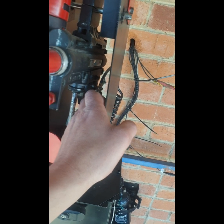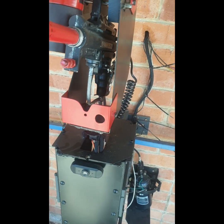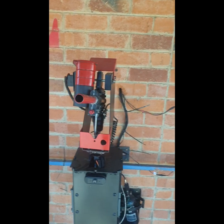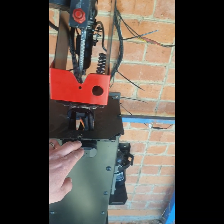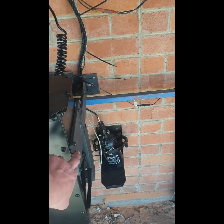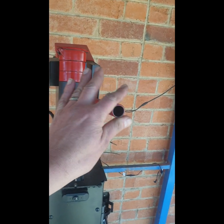Then we have our trigger servo, and she is located inside the handle so that it's out of the way, and all these wires run to the brains. I'm going to try and get in here at the back. That little box where you see that little LED light is the box where the Arduino board has the code that sends the instruction to turn left, right, up, down, fire, attack, blast, call it what you want. That's as far as it goes when it comes to the servos. In this application we used a small cheapish webcam with a small lens on the Rudolph Labs Sentry turret. You could see they mounted it to the side, but they used a fairly big one, so your field of vision is going to be more, meaning your sensor is going to pick up your target easier.